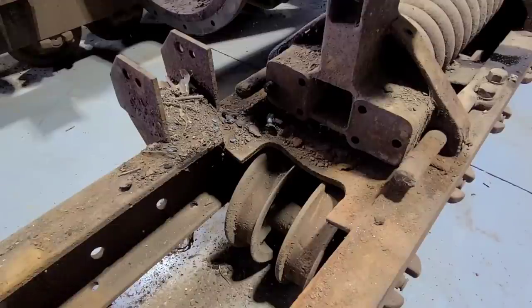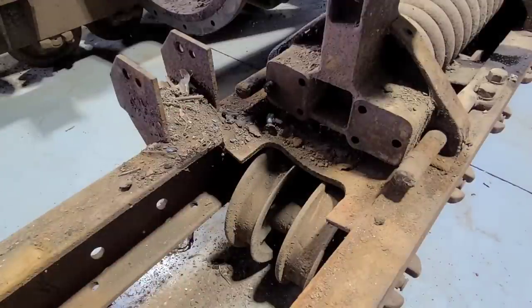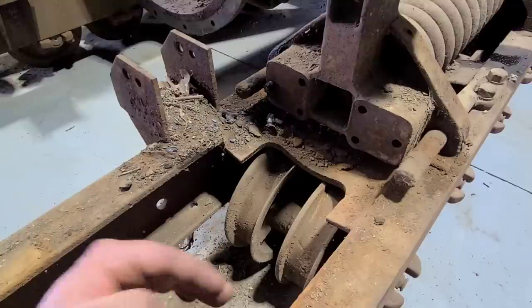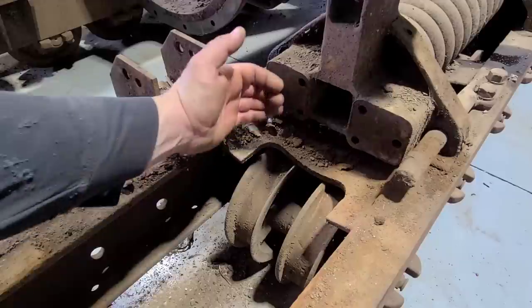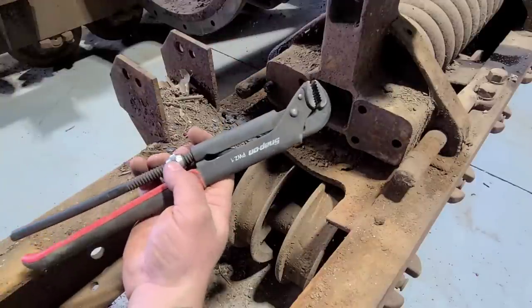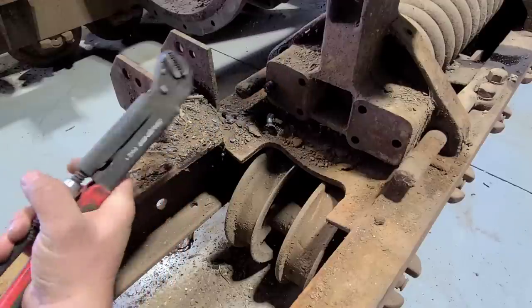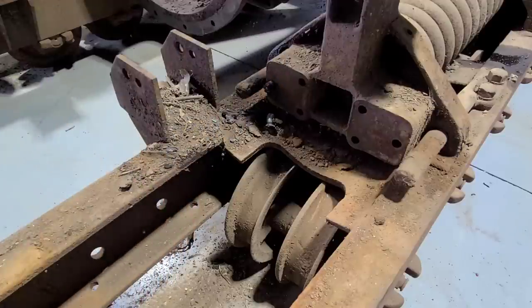In the past, I've had people ask why I just don't weld something to these bolts to then get them out. And the truth is, I find it easier just to cut the head off — you relieve all pressure then. You're not fighting those threads holding pressure back. And these Snap-on PWZ series pliers make wonders for grabbing a hold of what's left of this stud. You can walk it right out.